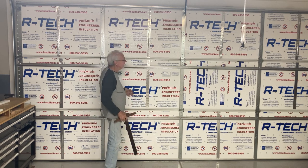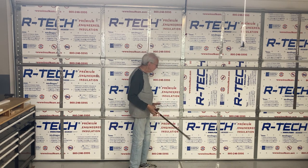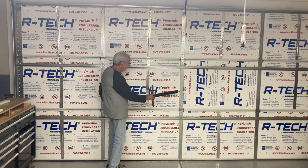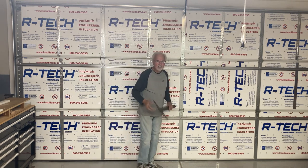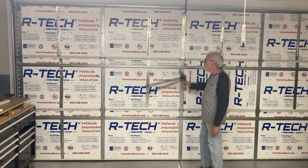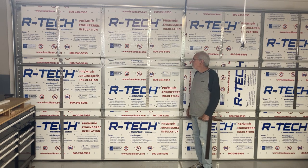One of the key takeaways: cutting the panels in half was just so much easier to put on. Even some of them that I cut in half, I didn't even need to tape - they fit together so well. The tape almost aligns with the vertical posts anyway. The whole thing probably cost me $75: about $70 for the panels themselves. I used six 4x8 sheets of foam insulation for 12 panels - two panels out of one 4x8 sheet.